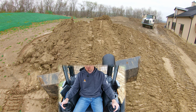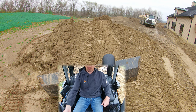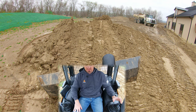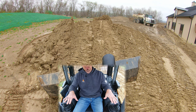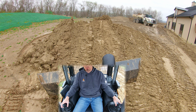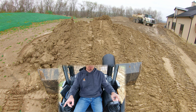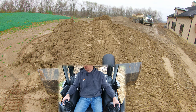For instance, if I tilt my blade all the way, as soon as my tracks reach the point I've cut with the blade, the dozer is going to start pitching in the direction I'm cutting. So to keep the slope I've got on my blade, as the machine pitches I'm slowly going to have to roll out of that, until I'm sitting sideways on the slope I just created. But in reality, the dozer blade in relation to my tracks is level — if that makes sense.